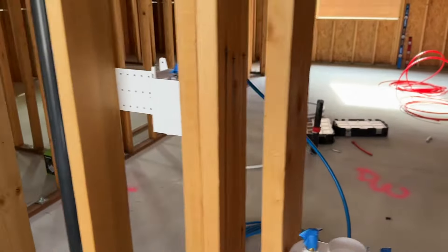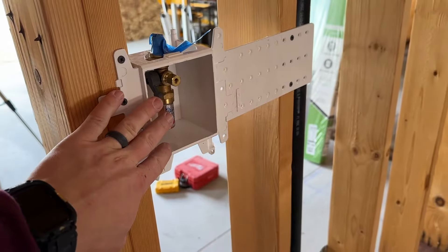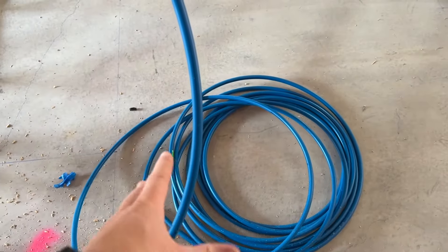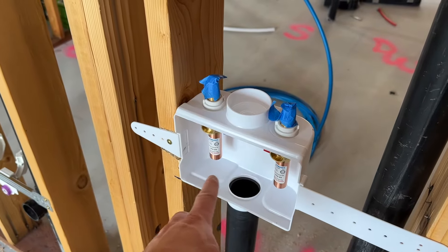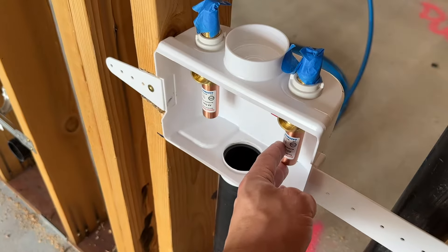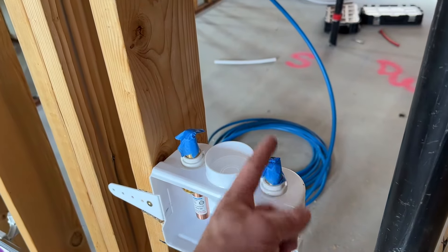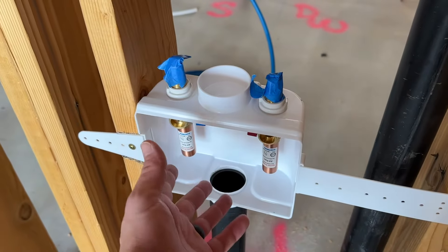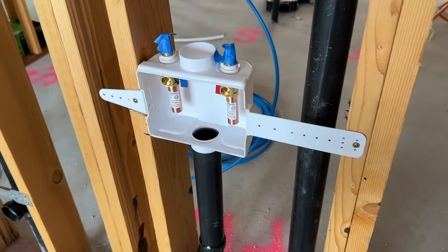We're mainly focusing on installing these here. I have another one that I installed over here for the fridge water line. You can see these boxes are really cool — I'll put links for all these in the video description. These are super nice. We have everything with a PEX-A fitting — this is the PEX-A expansion style. Try to stay away from the crimping ones, that is PEX-B. PEX-A is a lot better product — you don't have any restrictions in water flow. You can buy these kits that come PEX-A or PEX-B ready. We have our water hammer arresters here, and again these boxes can be installed in either orientation.